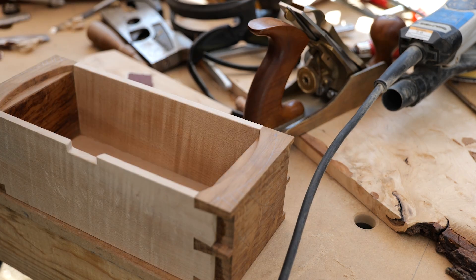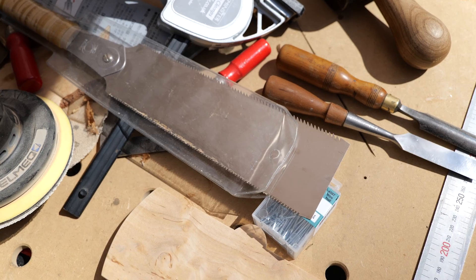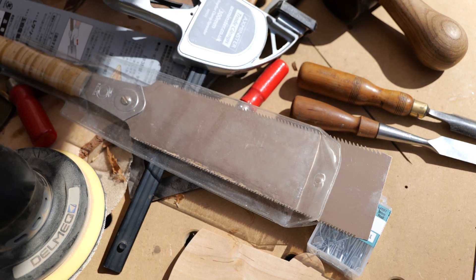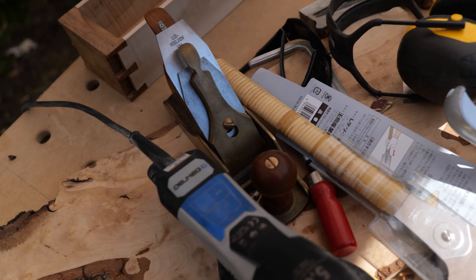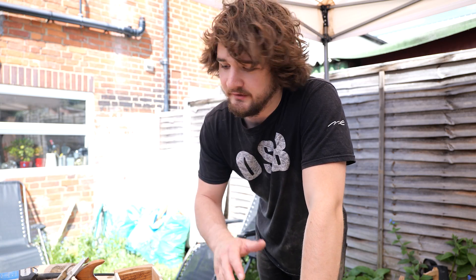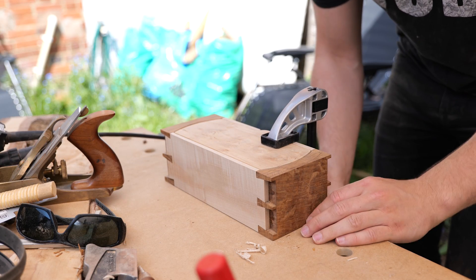The radiuses are marked on the ends — again using my good old bowl to do so. We are going to use a ryoba saw to rough cut that curve into shape, and then we'll finish it up with the plane afterwards. We'll also use things like spoke shaves and sandpaper to refine it. It's going to be fun.